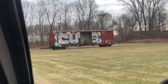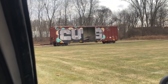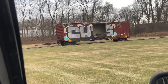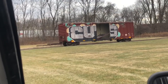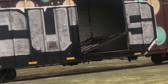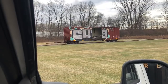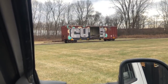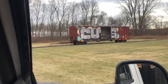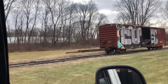So for right now, that's the catch up on subscriber inputs. We are at what we'll call the job site. The car was put on this siding so that we could fix it, and you're getting the first view right along with us. That's kind of an oops. That's the door there. This is a single door sliding door, not a plug door, a sliding door. And I wish we could have got here before it fell off. So our goal is going to be to secure that door inside that car. And where they put it, I don't know how we're going to deal with this. I don't think the railroad will accept it sticking out like that.